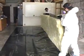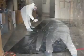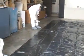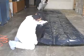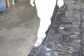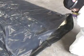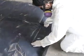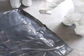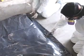With a person on each end, flip the insulation onto the other side of the 6-mil. Lay down some more glue and fold over the top, leaving a tab to be used to secure the insulation to the mobile home. To seal the ends, spray adhesive on the inside of the 6-mil sheeting and press the two sides together. Add some more adhesive, fold the edge over, and secure it with staples.